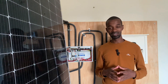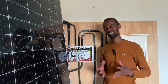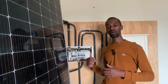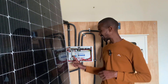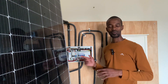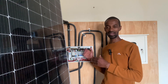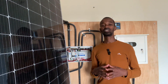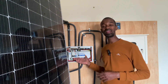Another important concern that Silver raised is about the works carried out on this consumer unit. I prefer that any works on the consumer unit first ensure that the main switch — what we refer to as the isolator — is off. When it is off, the bar will not be energized and you can go ahead and do your works in the consumer unit.